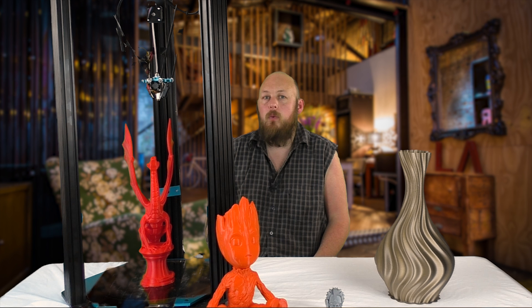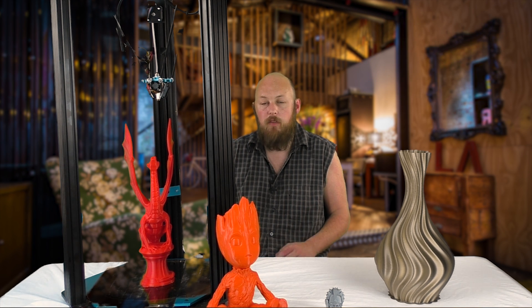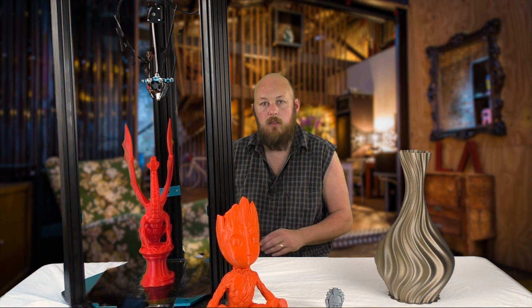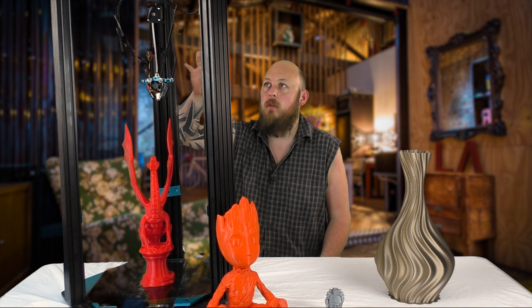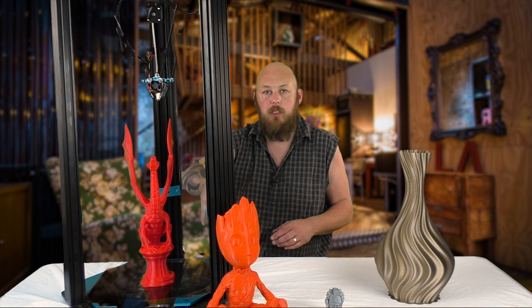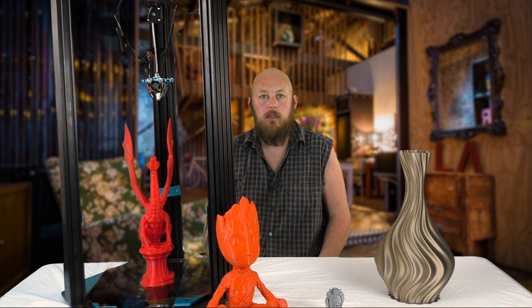The build was very, very simple. It only took me about one hour to one and a half hours to assemble the printer. Everything was pretty much pre-assembled with the exception of the bolt-together — much like the Trinus — where all you had to do was bolt the frame together. The hot end was all assembled, the rails are all assembled, the electronics are pre-wired. All you need to do is run your cabling, tension your belts, and bolt on the top and bottom frame, and basically that's it — you're up and running.